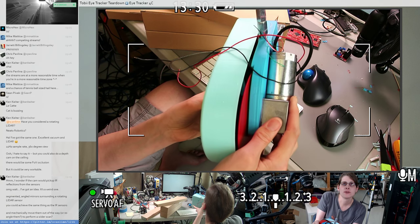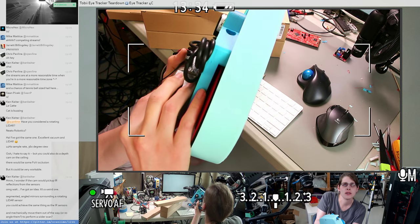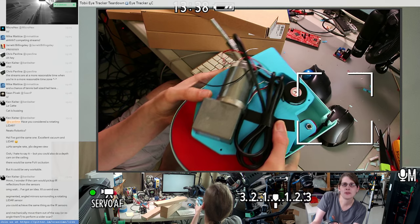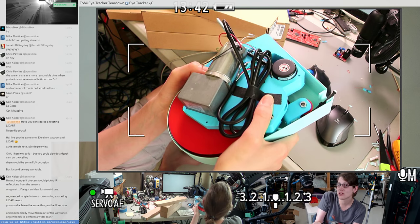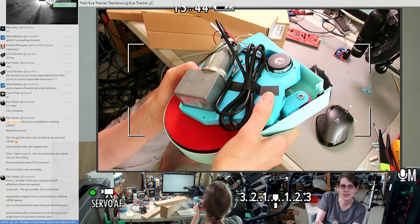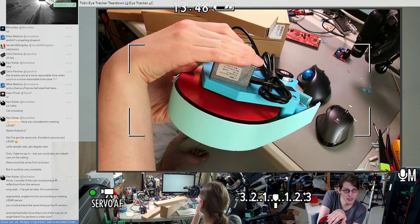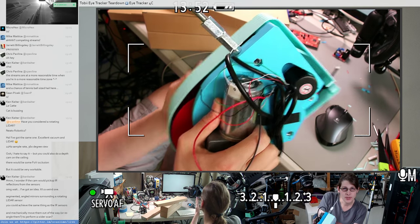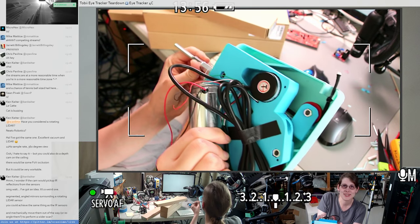But as for this material, I was just ending up with some flex in the chassis, which I thought would be tolerable, but at first it was just way too much. And then it turned out that motor had gotten, I think, damaged in shipping. This shaft was a little bit bent. So I swapped motors for one of the other ones that wasn't damaged in that package. And this one actually works pretty well, but it doesn't support that shaft as much as I'd like. So I'm lukewarm on this design.